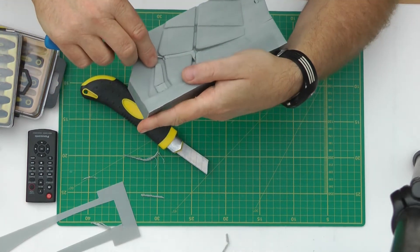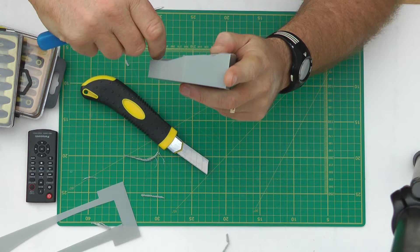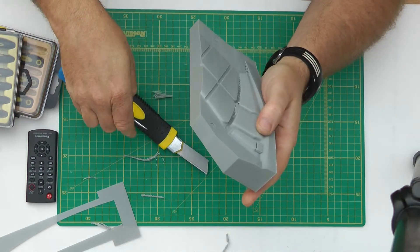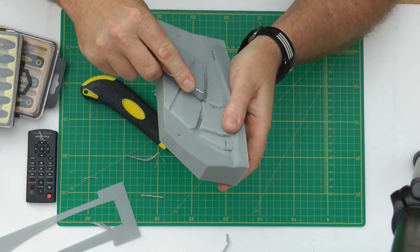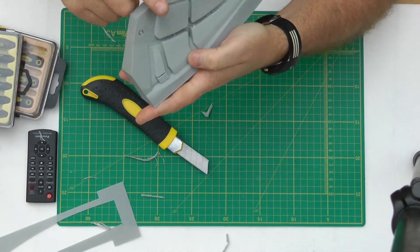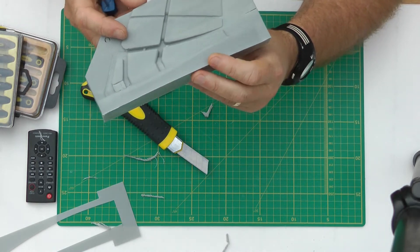I left these infills in especially so I could show them on the video. I've printed all the others and I'm wondering if they're all going to have that same problem. But that just comes from experience — I'll know next time that I need to increase the infill where there are going to be top surfaces. I'm using 0.1mm layer height, so it just barely managed to get the top of that all right.